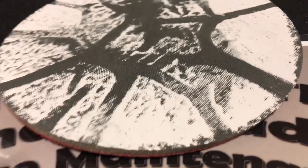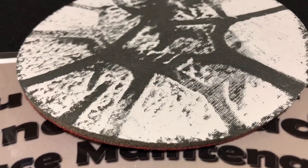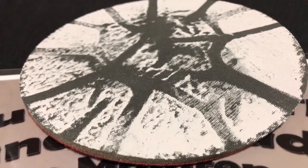Now let me show you the pads. These are the two sanding pads used to get this surface. This is the Abralon pad, and you can see the loading right there. When that loading happens, it destroys the pad's ability to continue to cut.